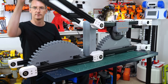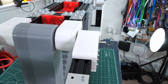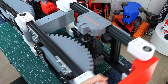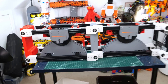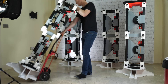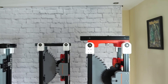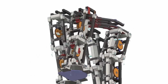The upper stage is another parallelogram with another back, front and gear, and that piece fits on the outside of the thinner lower leg, sharing the same pivot points — which is crucial for the inverse kinematics. There's another piece that goes on top of two of the legs, while the other two are slightly different. Again the gear tracks the big gear with two motors, giving us four motors total per leg — that's 16 motors for the whole robot. All tops and feet are on now and we've got four complete legs. Two of the legs are slightly longer with 3D printed boosters so they can cross over, allowing the legs to swing out and the robot to rotate on the spot.